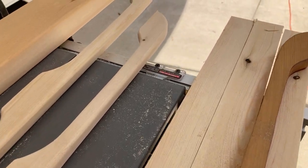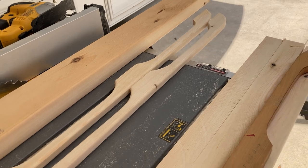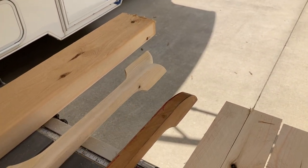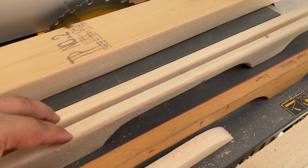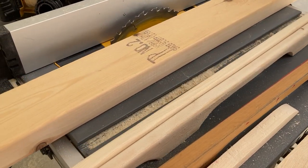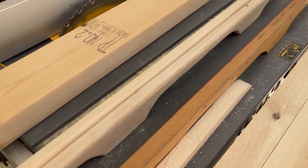Even if you've got a few little knots or pin knots, you're good to go. By pin knots I mean something real small and real hard — you could poke it with an awl and it doesn't move. In fact, try to drill through it and it's going to be harder to drill through than the rest of the lumber. There may be a strength issue depending on orientation, but we ship these off and the buyer drills their own holes so they can line it up with the holes in their boat. I just hate to have their fastener hole be off by a little bit from where their fastener is.